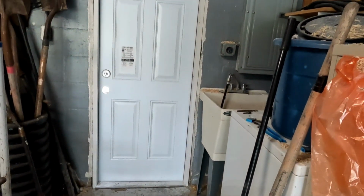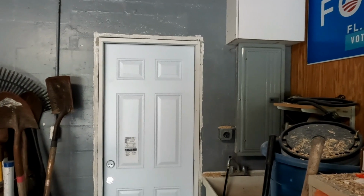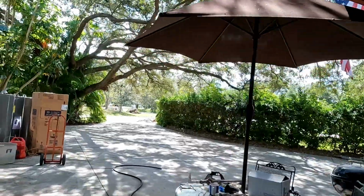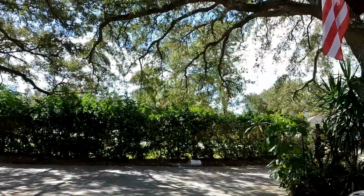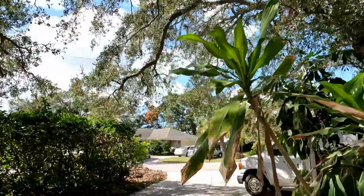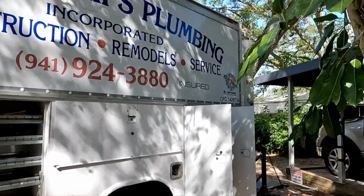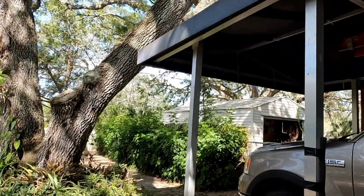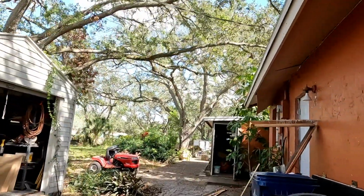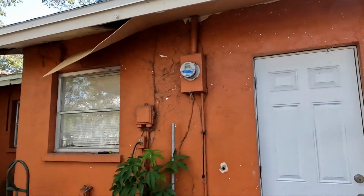All right guys, the door is in. It was not fun. I bought the wrong size door. If I had known it was the other door, I would have had to have ordered it because it's only a 28-inch wide door. But they had the blocks wrong on the bottom, and that's where I took my measurement, and unfortunately 6 inches higher, the blocks on each side came in a 1/2 inch, so it caused me to do a lot of extra work. The height, I had to do a lot of extra work, but she's in there.